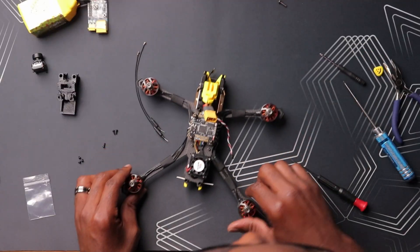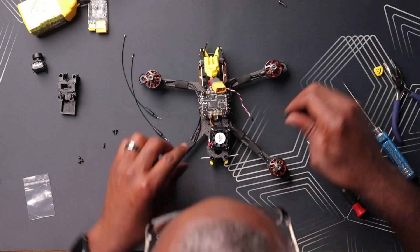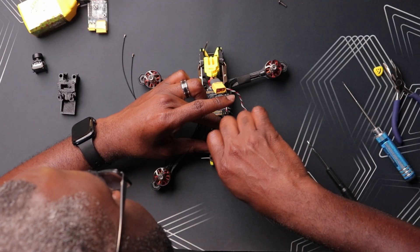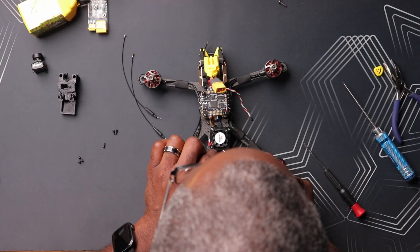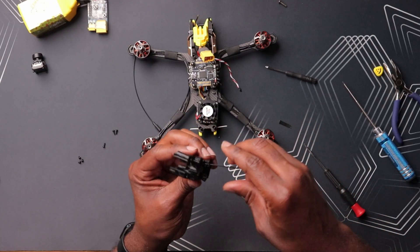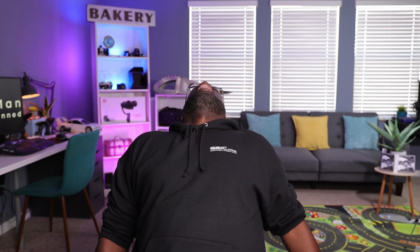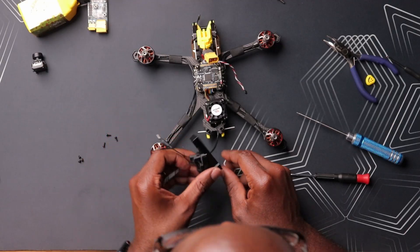That wire is through, camera's in the front. We're just gonna secure this to the frame. But before I do that, I want to install the antennas first because there's limited space here, and once I secure this to the frame I don't know if I'll get access to the UFL connector. There's a plate holding it — typical of most digital FPV systems. I'm just gonna remove that bolt, take off the plate, attach my antennas, and fish them through the TPU mount first because it's gonna be a pain afterwards. Make sure we do this right — we don't want to damage these connectors. All right, they're both in. We got the UFL antennas connected finally.